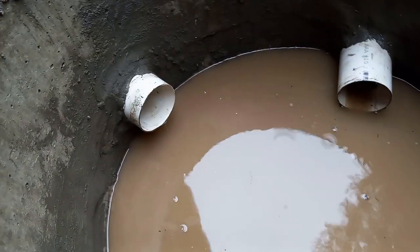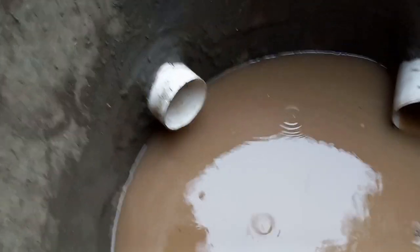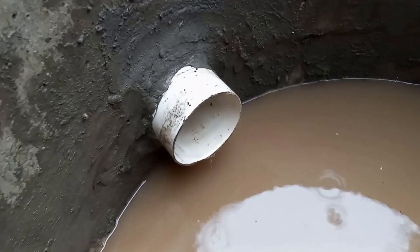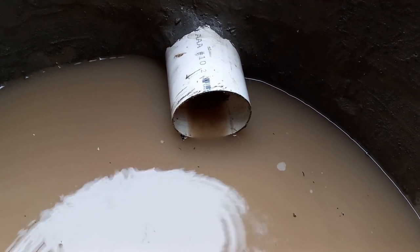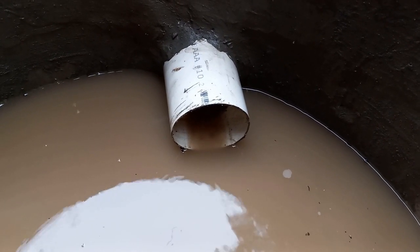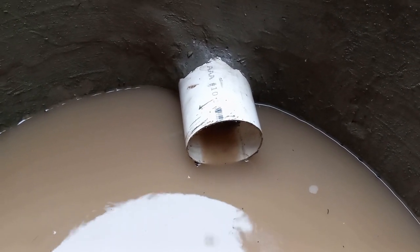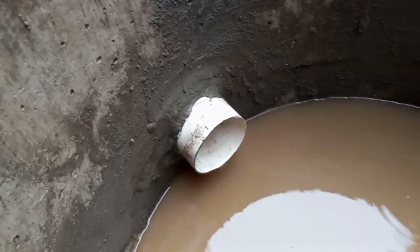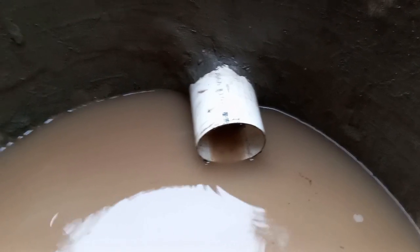There should be a minimum two-inch elevation of the incoming pipe — I've got three inches here. You can see the storm sewer outgoing pipe is working because it's lower. Minimum two inches difference is required, though it depends on the inspector. These two pipes come from the drain tile system, and this one takes the water to the city's municipal water disposal system.